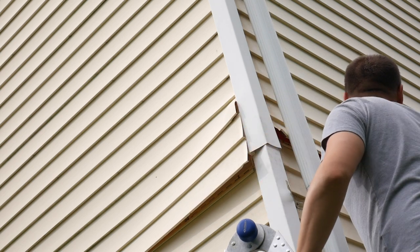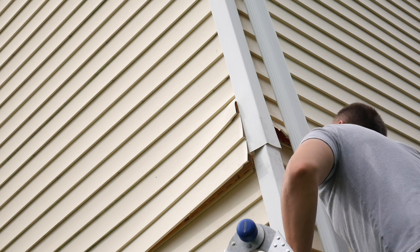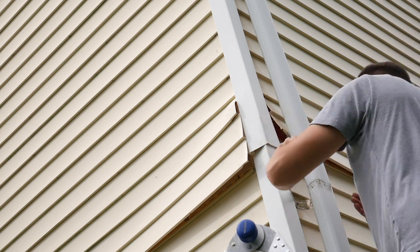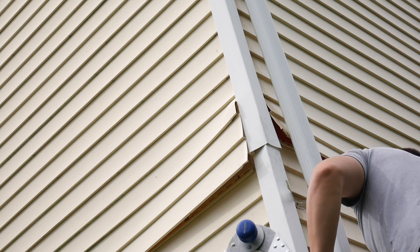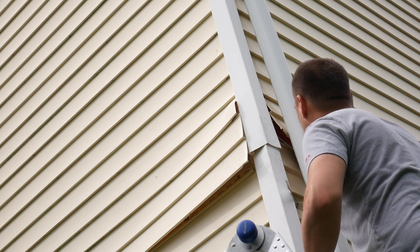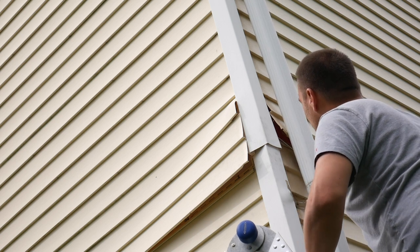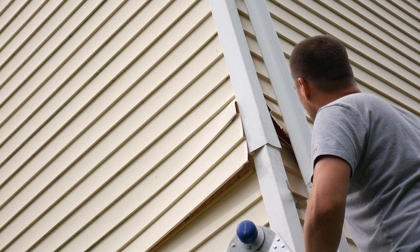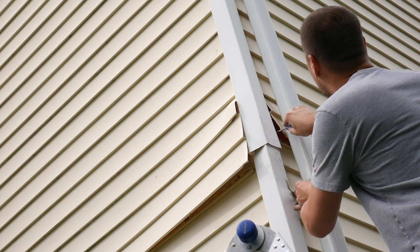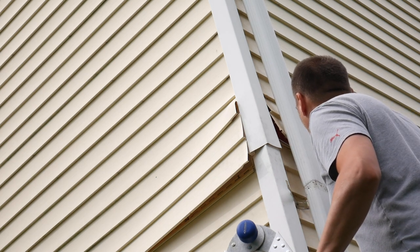After you figure out camera placement, you have to figure out where you're gonna run the wires — are you gonna go through the wall and do it on the inside, or do it on the outside? If you have vinyl siding like I did, or if you have a brick house and you have to drill a lot of holes, there's gonna be a lot of mess. You may need to run the wires through the inside of your home or through the attic — the attic might be the best option. But not all people have access, and in my case there was a lot of insulation up there that was blown in, and it was so humid that I would rather return this camera set than deal with that.